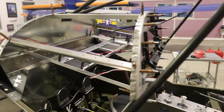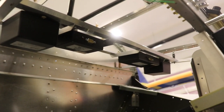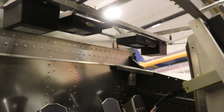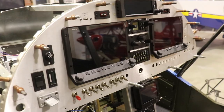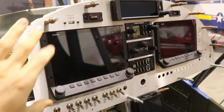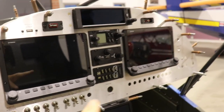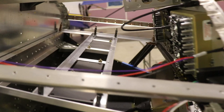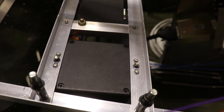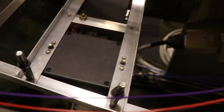I have two ways that I plan on accessing my avionics. Mostly it's from the bottom, and that's why you can see I have the avionics mounted on the bottom of that rack, because it's very easy to get under the panel with a screwdriver and unscrew a screw if I need to change something out. The other way I can get behind the panel, if I really need to, is to take out the four screws that hold one of these EFIS screens in, pull the EFIS screen out — there are just a couple of plugs that plug in there. So I'd have two big openings in the front of the panel plus being able to get under it. You'll notice on the backup battery for the EFIS screens I have nut plates, so I don't have to get a wrench under there to undo a nut if I need to change that battery — I just put a screwdriver under there and take out two screws.